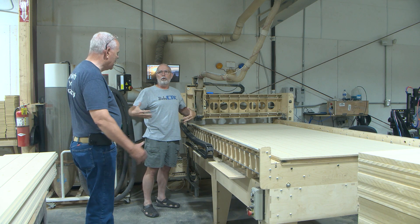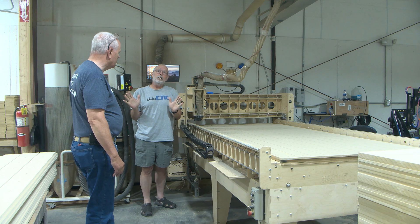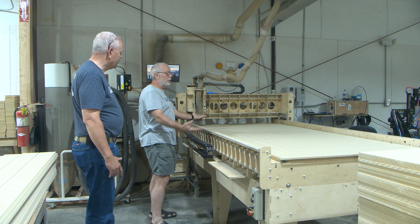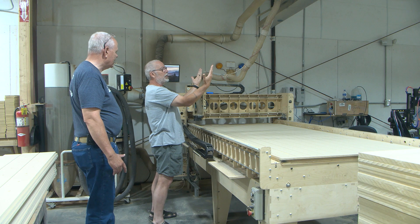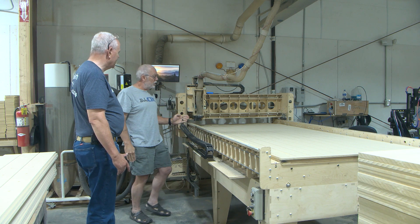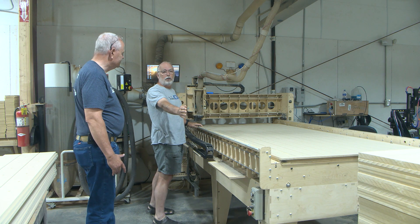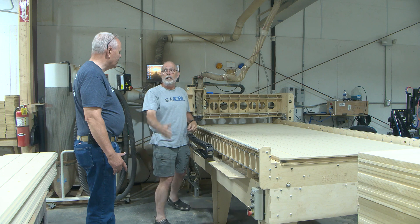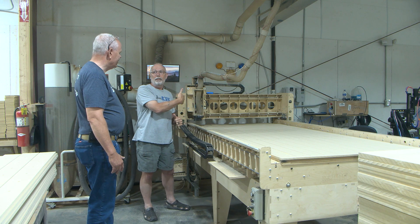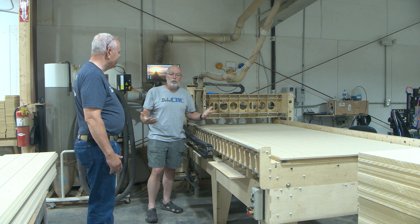Back in the old days when computers were large, it all sat here and this made it really convenient — back in the days of Mach, when you could run it off of a Raspberry Pi. So this was just really convenient. If you're looking at the computer screen, you want to be oriented on the side of your machine this way, and this would be your lower left-hand corner. So if I were to raise the machine up, you would see that this would be my computer screen facing down. So if I go up on the computer screen, the CNC would move this way; and if I go to the right of my computer screen, then it would be this way. So again: X axis, Y axis, right-hand rule, thumbs up — which means Z is positive up, which means our Z is negative down, which is the way Mach works.